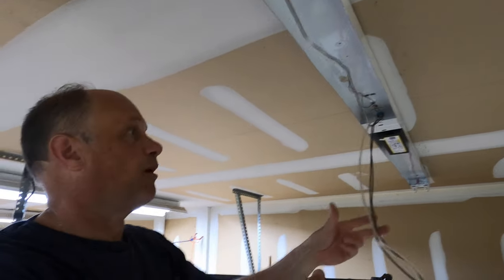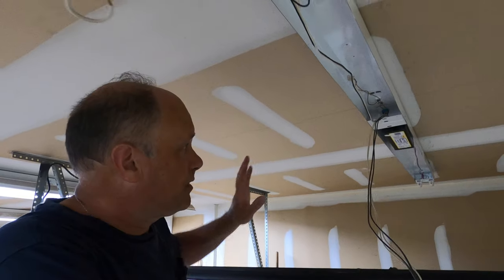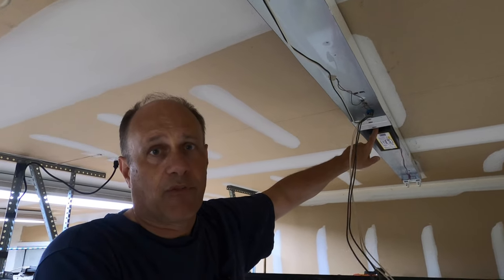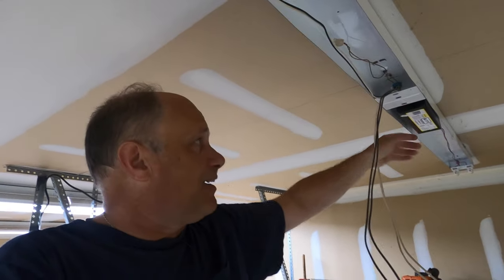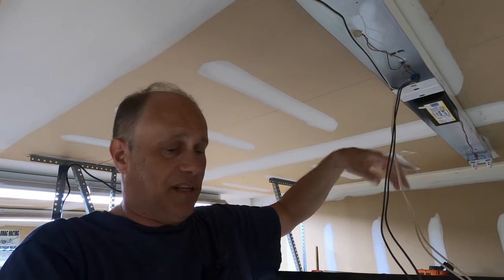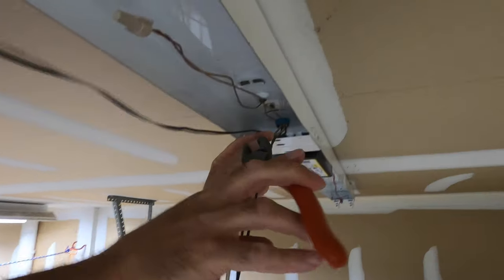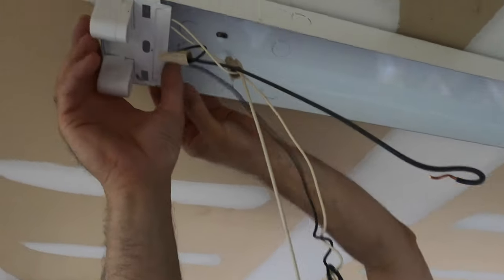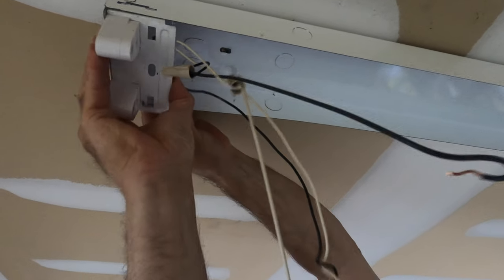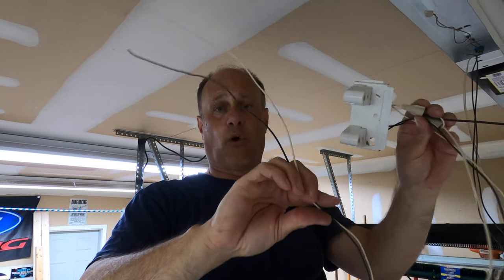You can see when I wire things I leave a ton of wire. These are our sockets — we don't need any of this wire anymore. The ballast is going to be bypassed — we're going to disconnect the ballast completely. You can disconnect it or you can remove it. I'm going to leave it in the fixture — it's not bothering anything in there — but I am going to disconnect the wiring coming from it, which is right here, and it is dead. I'm going to strip the end of the fixture by just pulling on the shell and pulling down and pulling out the socket assembly and all the wiring. We're going to use some of this 18 gauge wire over again when we wire our new sockets.